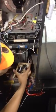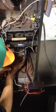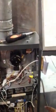Note that the positioning you put the board back on affects the schematic whenever you're dealing with the pin connection. The wires coming out of the top and the numbers on your schematic have to correspond to how the pin connection is set up on your board. So if you put it on there sideways, turn your schematic sideways — that way you'll be tracing the right wires out of your pin connection. That's just one tip to look out for.